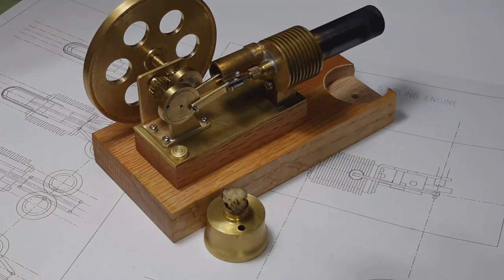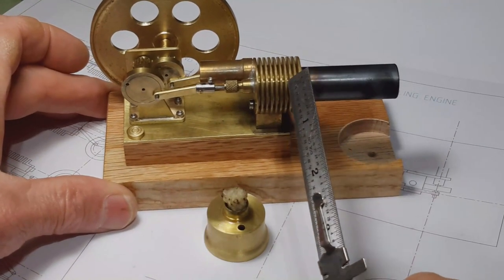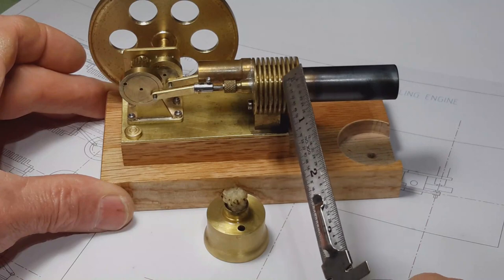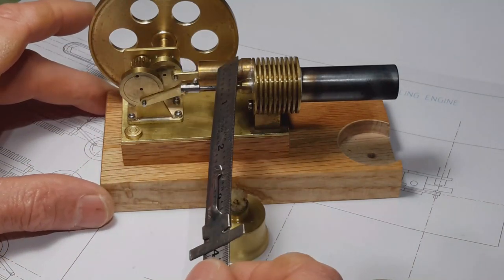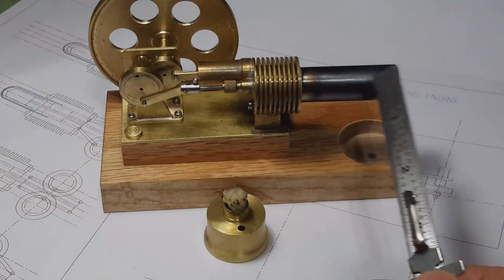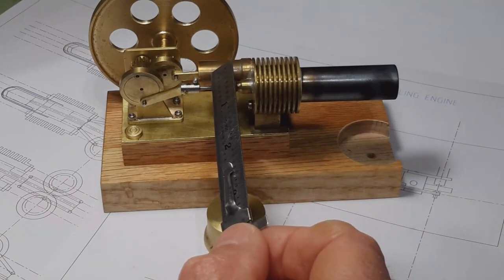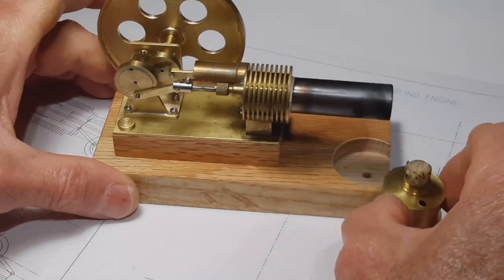By having separate tandem cranks, I was able to have a larger stroke for the displacer, so that the displacer travels the full length all the way from very close to the end of the hot displacer tube to the very end of the cool end on this side. And I was able to make a smaller stroke for the power piston, because similar to the other engine that I built, I found that the volume of air that is produced in the cycling of the displacer wasn't quite enough to carry the power piston through a complete stroke. So I shortened that up so that it more closely fits that volume of air produced.